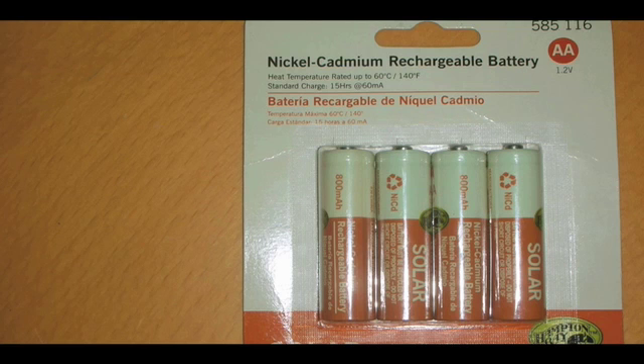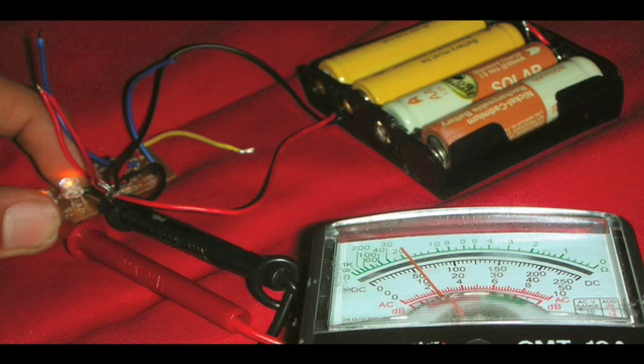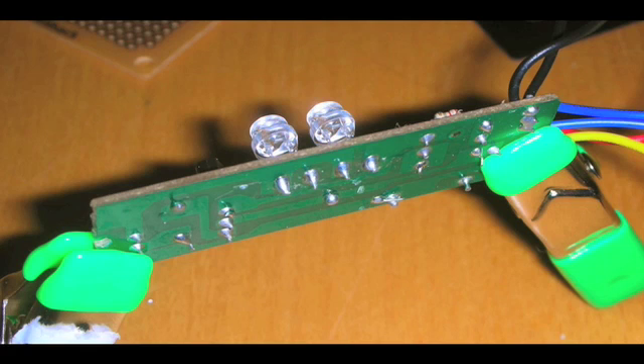Afterwards, get a new 4AA battery pack and additional batteries. Our local store didn't carry just two rechargeable AAs by themselves — only this pack of four that was specifically meant to be used with a solar path light. But most any rechargeable AA will work. Cut the old battery pack and wire away and attach the new battery pack. Even though there are now four AAs hooked up, the LED light will still receive the same amount of voltage as before.